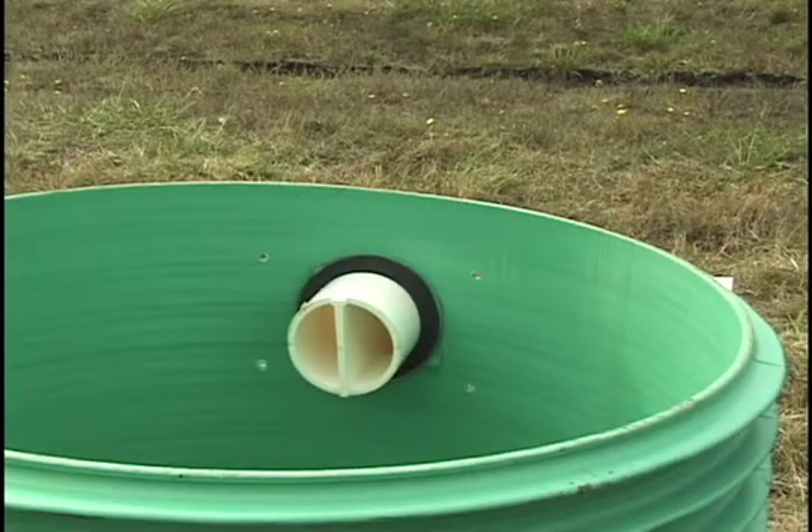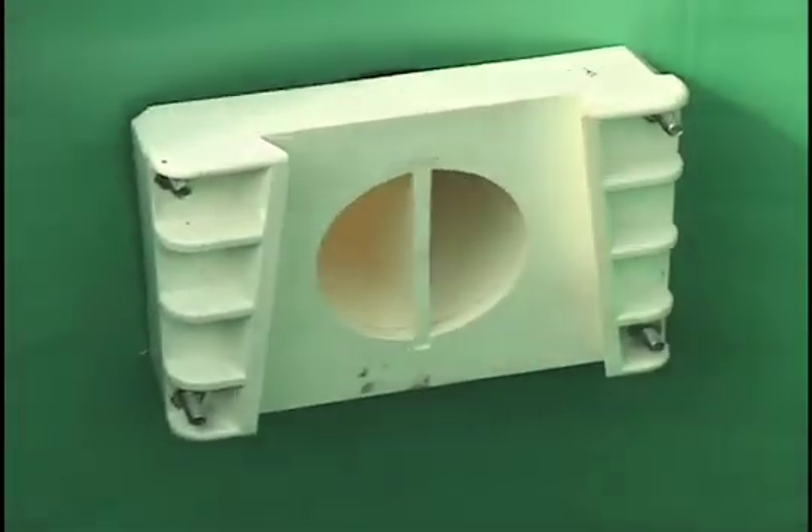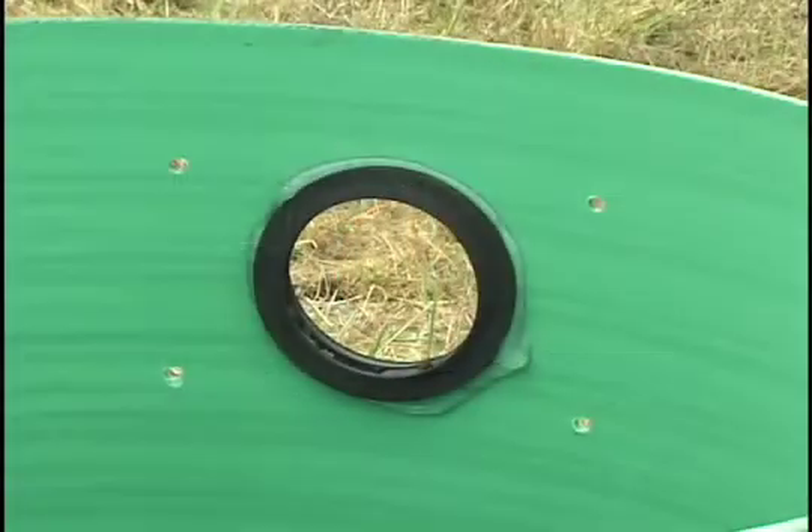If you are using the grommet method, the RSV assembly penetrates the riser through a 3-inch grommet. The split-flow T mounts on the outside, and the RSV cage and body are mounted on a quick-disconnect fitting on the inside. The grommet hole is usually pre-drilled.